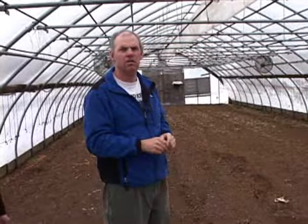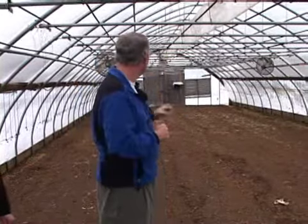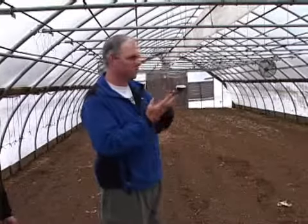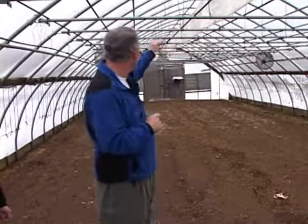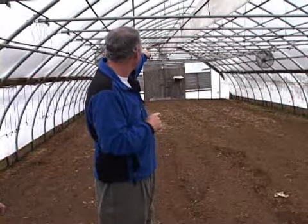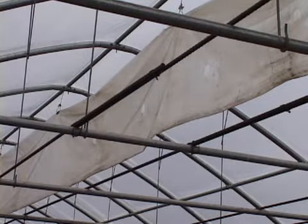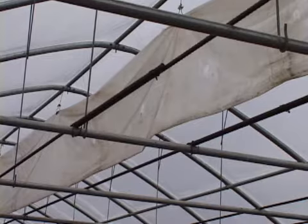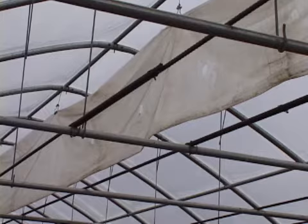There are three stages of ventilation. The first stage uses a fan at the east end connected to a tube running down the center — not used for heating, but as an inexpensive fan-jet that sucks air down the tube and dumps it into the house. The horizontal airflow fans then mix that cold air up. This cold-weather ventilation is used during much of March for winter cooling.